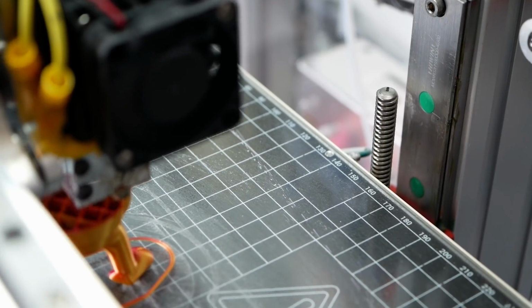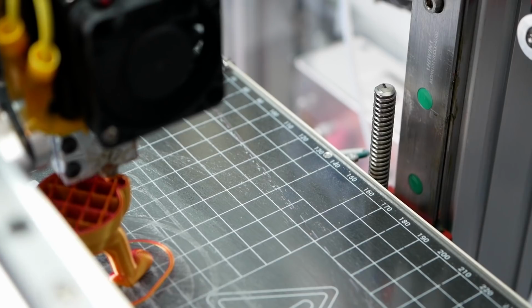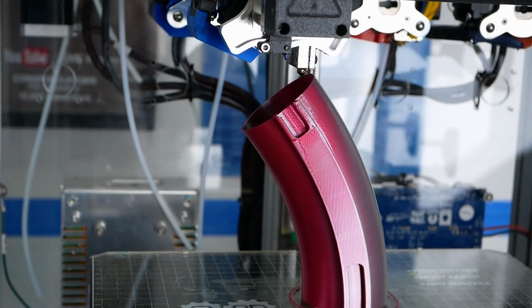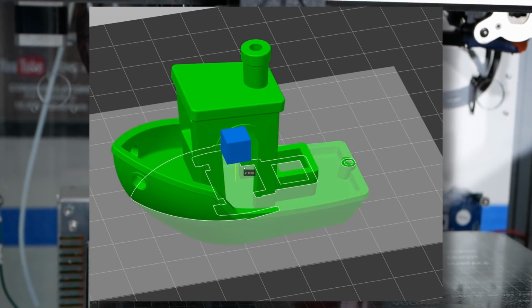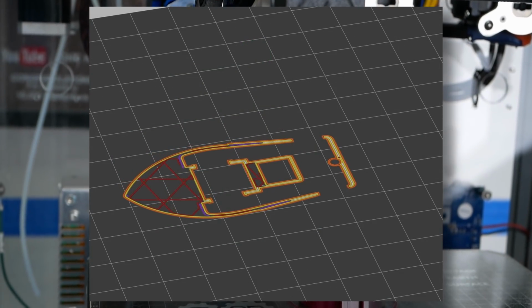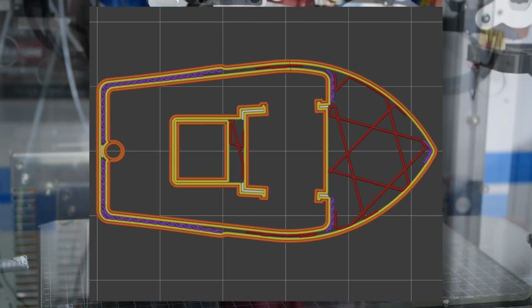This nicely illustrates the problem with non-planar 3D printing. Hardware isn't the problem, because all our 3D printers can easily run all of their axes simultaneously. The big problem is software. Regular 2.5D slicing is super easy. You slice your STL with a plane and get all the perimeters, which then get filled with 2D moves. Doing that for each layer and just lifting your nozzle after each one gives you your final part.